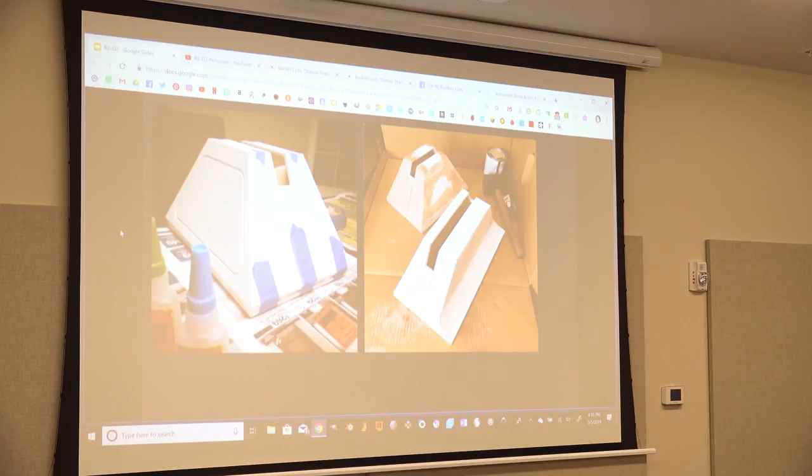Don't do what I did. When I 3D printed, I'm like, so many pieces, let's print them fast. And so I did low resolution, so you can see the lines in that. And I thought, this will just go quick. And then I'd have to Bondo the whole thing and sand it. Well, if I had just done a high resolution, I wouldn't have to Bondo and sand so much. But it all kind of evens out, I guess, because 140 prints in high resolution would have taken probably another extra month to print all the pieces.